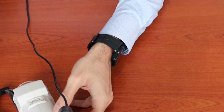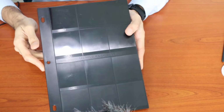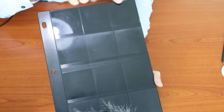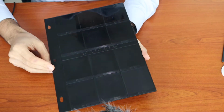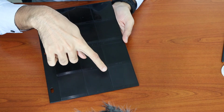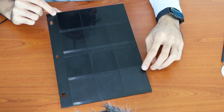Let me illustrate. Let me zoom out. I have a sample plastic piece from a single mold, a black piece, but with different surface conditions. I hope you can see it well here. On top it's high gloss, and at the bottom it's matte gloss. SCI mode is a mode where it will measure color without the interference of the surface condition. You may notice that typically a surface with matte gloss will always look lighter than a high gloss surface. So the SCI mode is a measurement that does not take into account surface texture or glossiness,